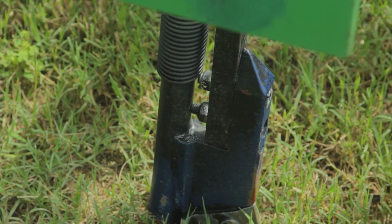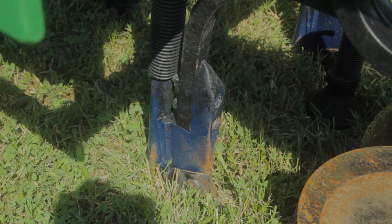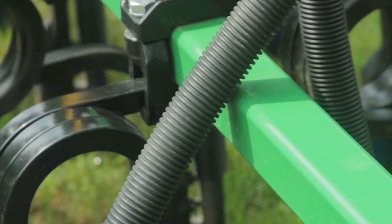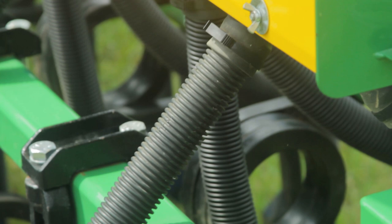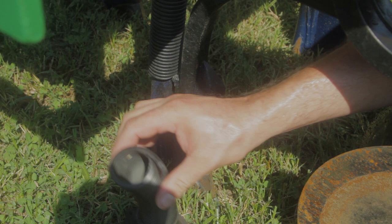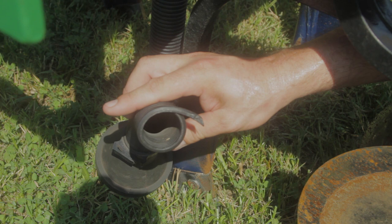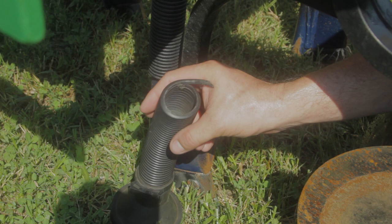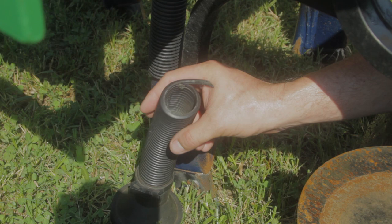Here we have the tine and the baker boot that travels through the soil profile, along with the seed tube. The seed tube is unique — it is corrugated on the outside, but smooth on the inside, so seed of any size travels through it. If the seed tube is bent, seed does not get blocked or heaped up. Seed enters through the top, travels through this solid steel tube into the ground — it is placed exactly where you want it, not simply dropped.